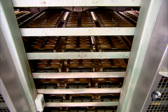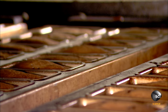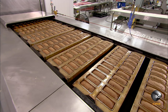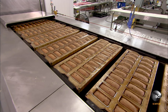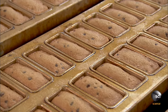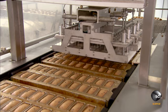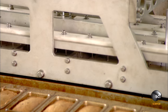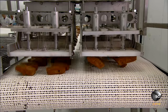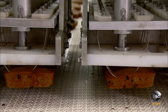The next station on the line is a multi-level vertical cooling chamber. Its fans draw out the hot air while blowers introduce filtered cold air. When the pans exit the cooling chamber about 25 minutes later, the loaves are just slightly warm. A robot now descends on two pans at a time, jabs the loaves with needles to lift them out, then withdraws the needles to drop them on a ventilated conveyor belt to help the loaves finish cooling.